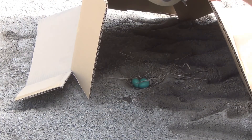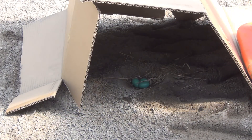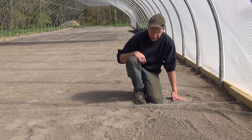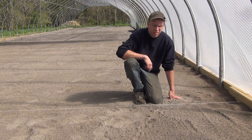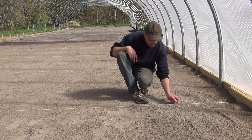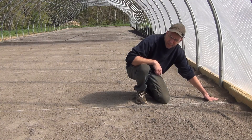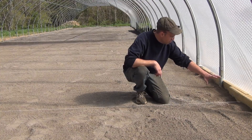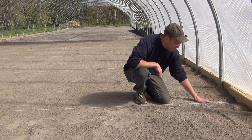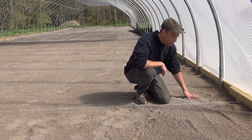I haven't seen any evidence of birds coming back to the nest, so most likely it's not viable anymore. I'll give it a little more time, but most likely I'm going to have to discard it. I got into the groove and kept working without the camera, but basically I've re-leveled the whole greenhouse site and set all the sand so I can just get my fingers underneath the string — about a centimeter at the edges, and about three inches of sand through the middle. The edges where I'd done the trench had settled over the winter from freezing and thawing, so I borrowed a friend's plate compactor to go through the whole greenhouse, pack this down, and then add more sand in the low areas.